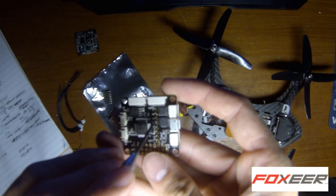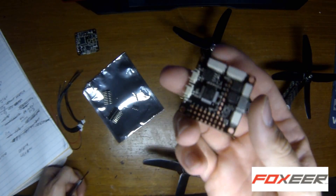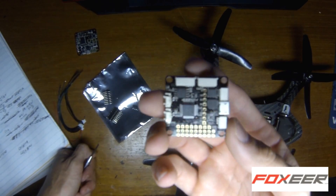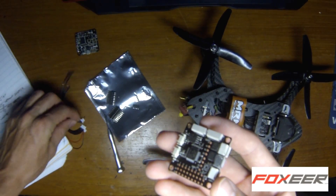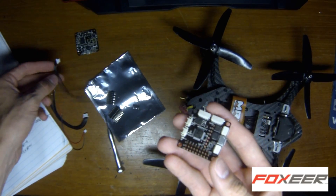Then you've got two separate UARTs, which are also linked to the smart ports, and they allow you to run up to four different individual components per port — though I'm pretty sure it's one at a time. I only run OSD and the black box, so I don't have anything else to plug into it. The confusing part is it only comes with one plug, and I haven't seen more on their website, so if you need more you might have a little adventure on your hands.